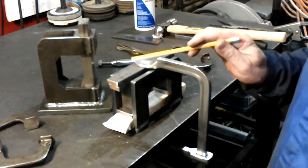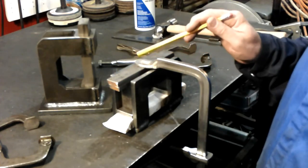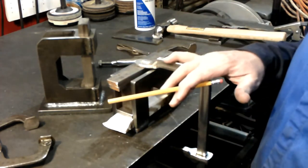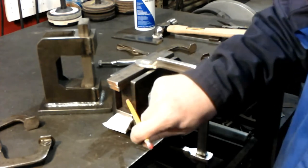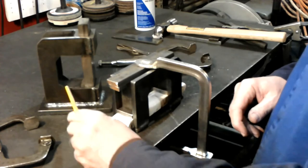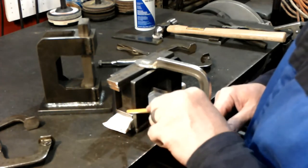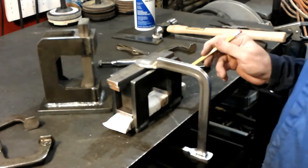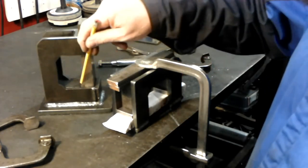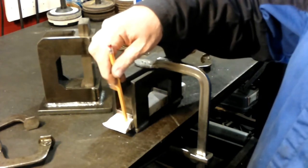Okay, what I've done was I stacked some pieces up right here so that it's above my sides, so my clamp would sit on those. And I have it clamped up under my welding table so it's pulled down. Those are pulling these inside pieces here, which will end up being flush right here when we weld it together. I've got it centered right now, so it's pushing this top and bottom, well, that's actually the bottom and the top pieces that go right here tight against the die with the paper on it.